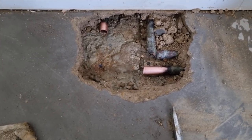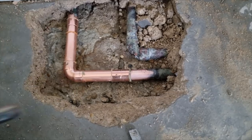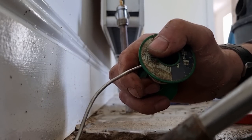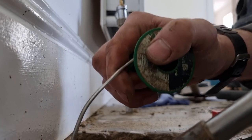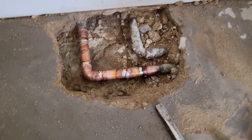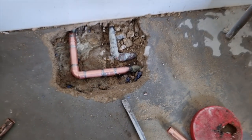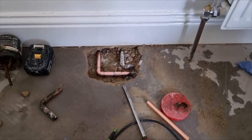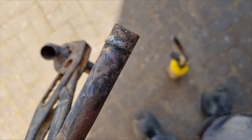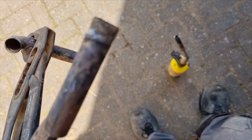This is just showing the new section of pipe I've made up to replace the old. I've fluxed it really well - I've probably used a little bit too much flux, but when you're in a floor you just want it to flow properly. Just give your pipe a really good wipe off at the end - you don't want any flux left on it whatsoever. I've just sweated that pipe and it's never even soldered underneath. The top is alright - just a poor joint.